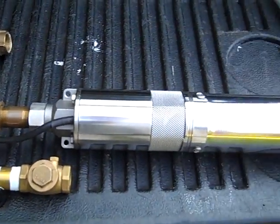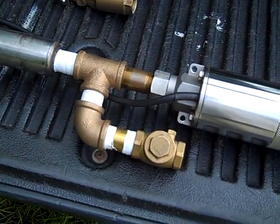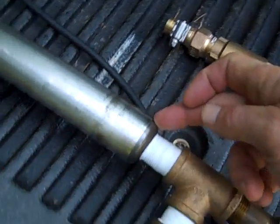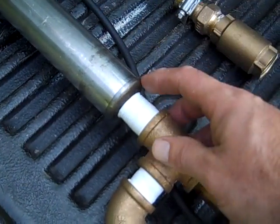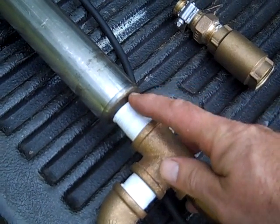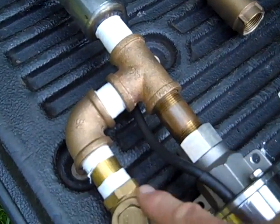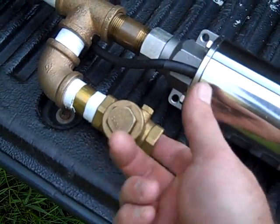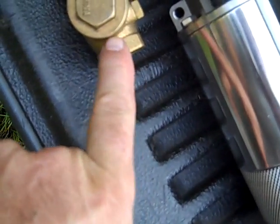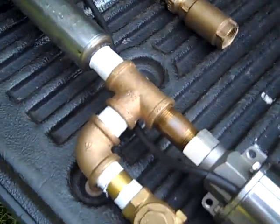What I wanted to do is add a solar submersible to the bottom of my hand pump, and that's what I've done here. At the bottom of the cylinder I've added — Teflon taped and basically welded — a stainless steel nipple to the bottom of that check valve, allowing me to thread on a tee. You see the elbow and another check valve; I just put a swing check on here. You can put a foot valve or whatever you want.